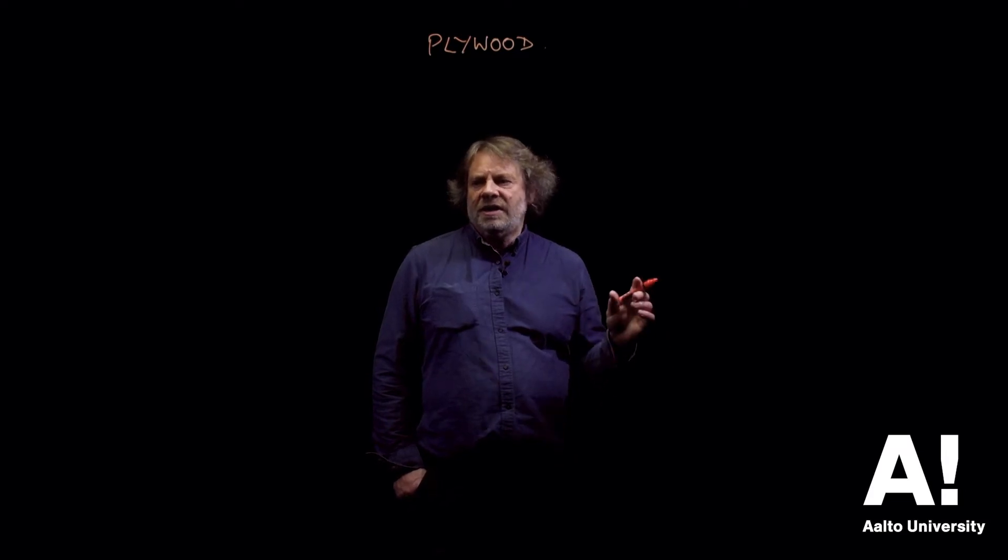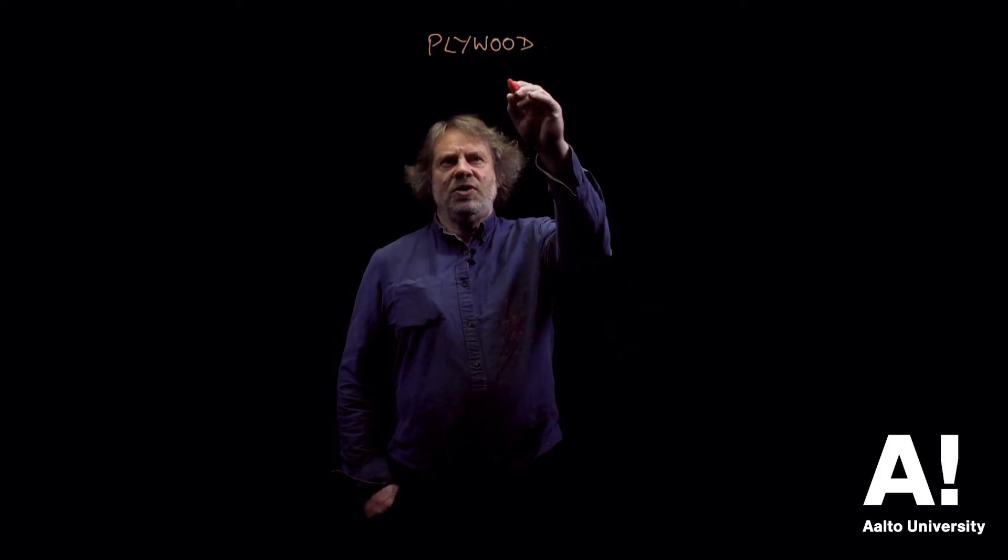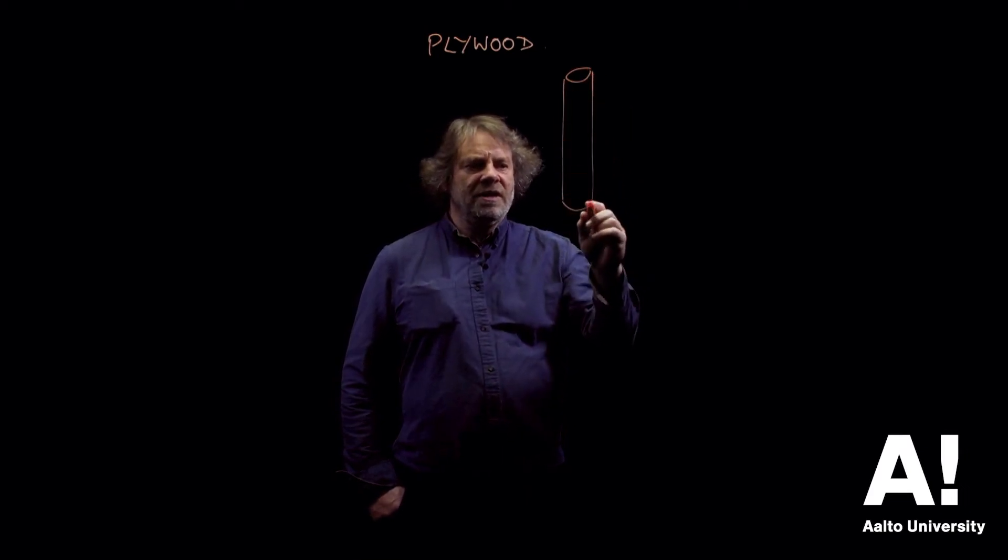Plywood is made from wood veneers obtained from trees that are either specifically grown for veneer production or happen to grow that way due to conditions in the forest — normally fairly closely spaced. They're pruned to remove all branches so they don't get knots, or they naturally prune themselves because of snow loading on the branches in winter, causing the branches to drop off. Either way, what you want for plywood production are long, thin logs without any branches, preferably as straight as possible.